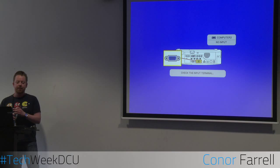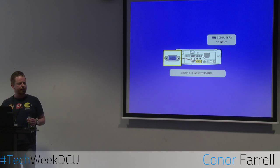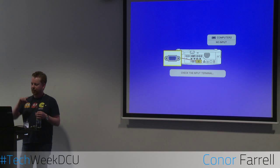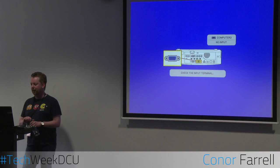Okay, well, you see, there are different types of modulation and different modes. I talked there about amplitude modulation, which is just the height of the wave, and frequency modulation, which alters that frequency slightly. You can get other modes, such as phase differencing. It's PSK, it's also ASK, which is amplitude shift keying, and FSK, which is frequency shift keying and stuff. They can contain a bit more information than just a simple frequency shifting or amplitude changing. But yeah, it's all down to the mode that's being used. I wouldn't know too much about Wi-Fi technology myself, but I reckon that's where the information would be.